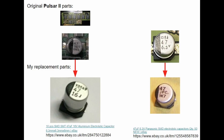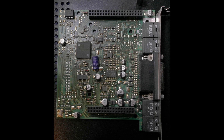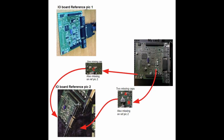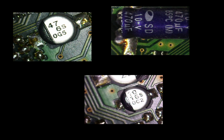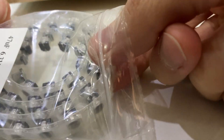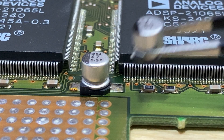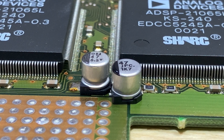I went online and found some alternative components suitable to replace those on the board. You can see those described here for the main board and also for the IO daughter board — I have the ADAT one. I initially thought my IO board might be missing some capacitors as well, but I checked mine against reference images found online and those gaps were supposed to be there. The daughter board has slightly different components to the main board, and these are the alternatives I found on eBay. Once the components arrived, they come in nice spools — surface mount capacitors, the same size and specification as the ones being replaced.